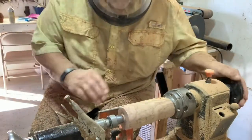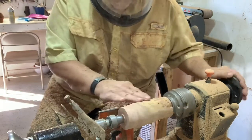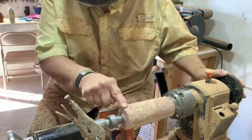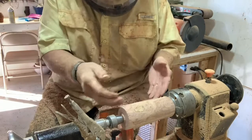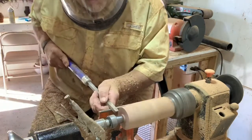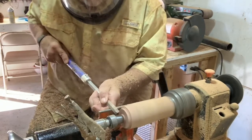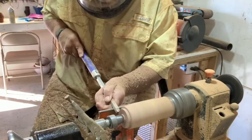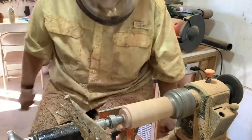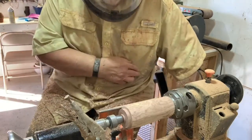Okay, got her pretty much rounded out. I've already started with my barrel shape there a little bit. Actually a nice piece of wood in there. I'm not going to sand it yet — I'm going to put a tenon on this thing's side real quick so I can chuck it into my lathe. Let me do that real fast. Okay, let me chuck it up and then we'll see what we can make.